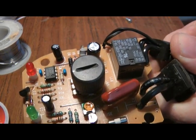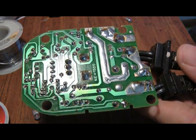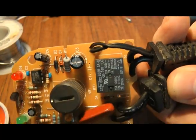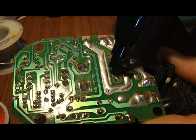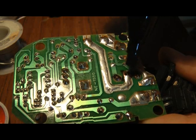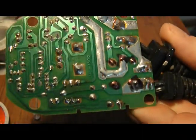What we need to do here is take this component. What you have to do is flip this over, and I'll go ahead and mark with a marker what we're going to be doing. Sometimes you just kind of have to flip it back and forth and say, okay, I see the relay, flip it over, I see where it's soldered through. There's three places right here, right here, right here. This is the switching side — this is the place where it's actually doing the control — and this is the side where power is routed to the light bulb or the heater. So basically you've got those three places.